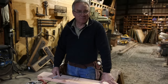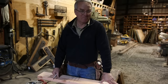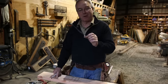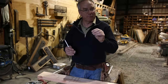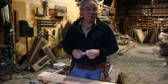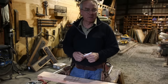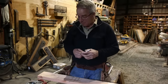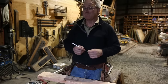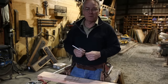So in the simple task of measuring and marking and cutting a board, there are at least four specific ways to screw it up. And besides that, each of those incremental parts of the process has its own opportunity for a variation or a margin of error that can accumulate. So when you actually get the piece to put it in, you have no idea how you got so far off. First, the measurement can be incorrect, particularly on an inside measurement. Second, you can put the mark in the wrong spot, either by mentally dropping an inch, adding an inch, or just inattention in placing the mark. It's easy to do, guys.